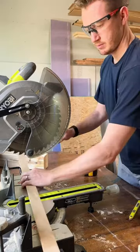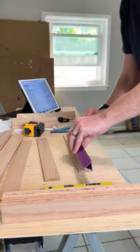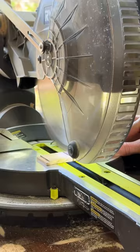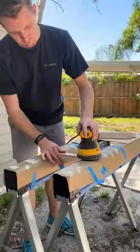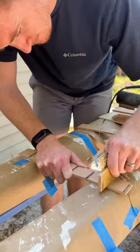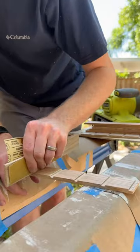So I cut all my pieces to length, and because I'm going to glue these little pieces, it's important to create little dados. A dado is a groove in the face of a board, which is good for creating extra surface space, which makes a glue connection between two pieces much stronger. I also have extra dados created because they create pockets to allow me to slide pieces into place.